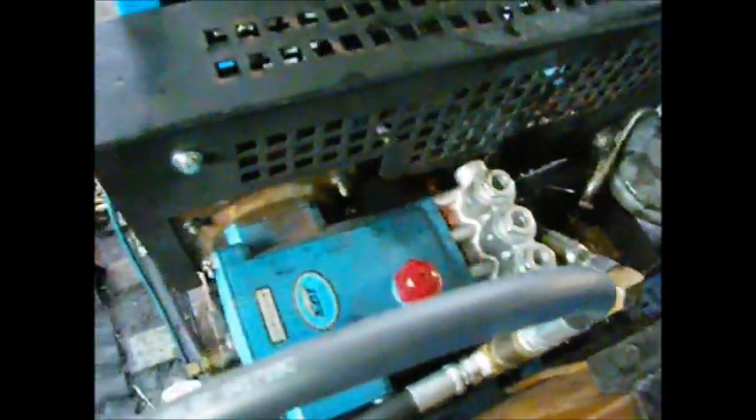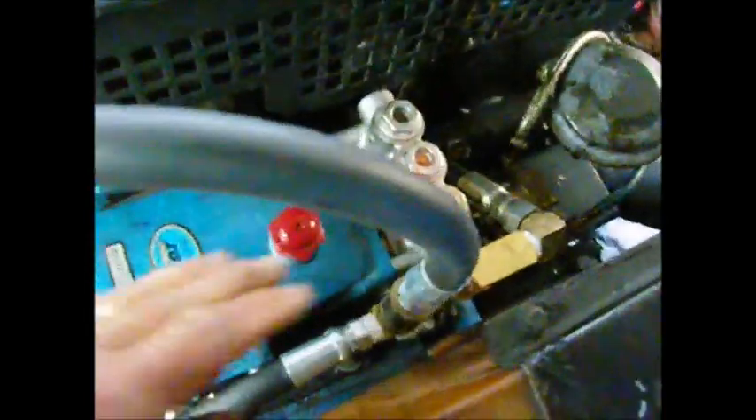What I did is I added it right on there using a 3/8 male pipe thread, 18 inches long — it flexes and moves with the pulsations. This must be on all pumps any time you do an installation with our heat exchangers, and really all truck mounts should always have these. This one originally had a pulse dampener but I think it was taken off when the pump was replaced.